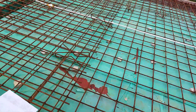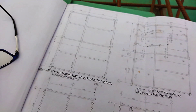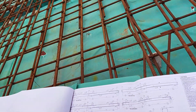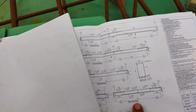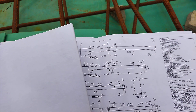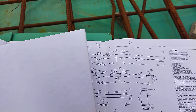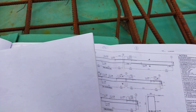Now let's also check the beam. First, look at the framing plan to identify the beams. We're checking the middle beam, which is TV9. For TV9: at the bottom there are three 20mm bars, at the top also three 20mm bars. Extra bars are two 20mm at the bottom and three 20mm extra top bars at both sides. The beam depth is 600mm. Let's verify these bar counts.